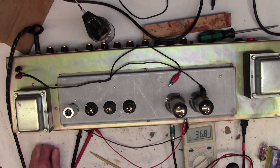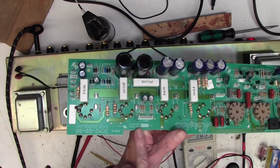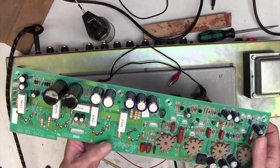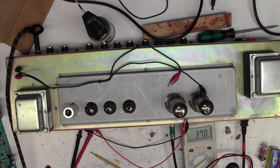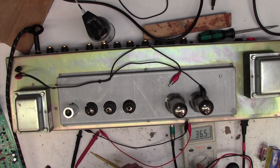I'm just going to leave this amp on for an hour now, because this is one of the early boards. If you remember, this board here is Issue number 3 - a very, very early board - and the one in the amp is a 5. When I replace a board it's up to Issue 26 or something. So this could be one of the boards that has the runaway bias problem, although I suspect it isn't because he's never complained of blowing HT fuses. You can see it's crept up to 37, which it will - it just keeps creeping up a little. This one's 37 as well. I'm very happy about that. I'll put the amp back together - it's been a bit of a mission but a good solid fix.